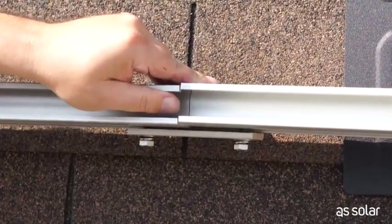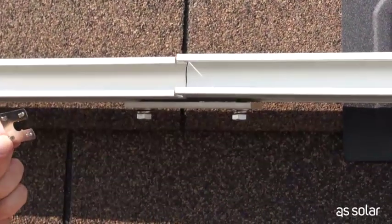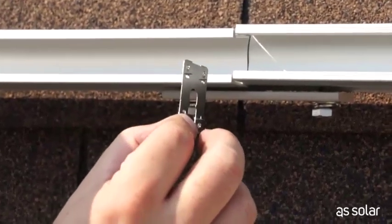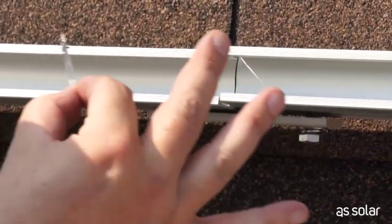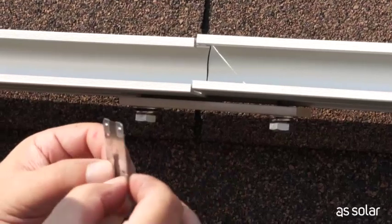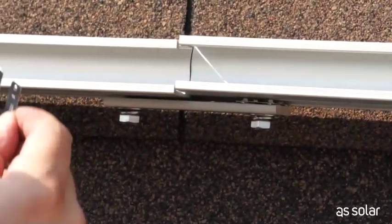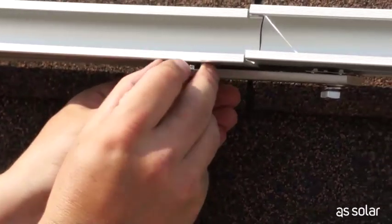I want to take a little aside now and show you one last piece you're going to be working with — this piece right here. This is called a weeb, also known as a grounding washer, and these are very important. When you insert weebs behind bolts or nuts, it grounds all the parts of your system together, turning it into one big piece of metal instead of a bunch of separate ones. In the case of the joiner, I'm simply going to insert them around the bolts. They're U-shaped and they just clip right in. Take the U — there are little tabs and they have to be facing up — and slide it in.